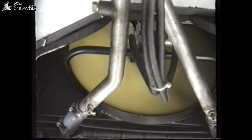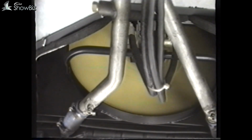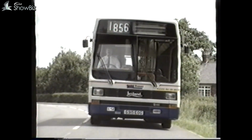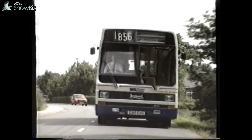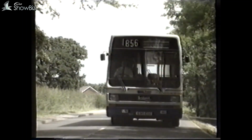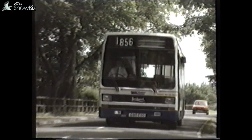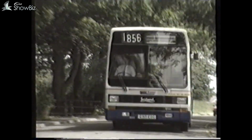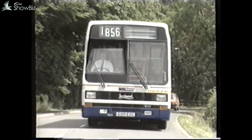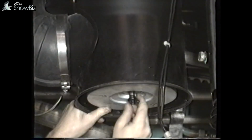If the radiator matrix is now covered up, the hydraulic fan should cut in after a period of 4 to 5 minutes. During this test, always monitor the engine temperature light, and if this comes on, the test must be stopped immediately and investigated. It should be remembered that if the thermostat fails in the open position, the engine will run cold, causing high wear rates, dilution of the lubricating oil, and subject the engine to high thermal stresses due to the rapid fluctuation in operating temperature.